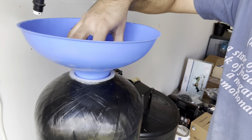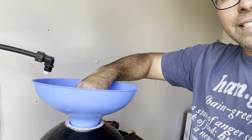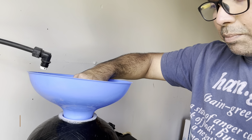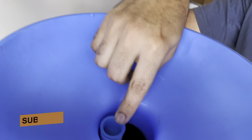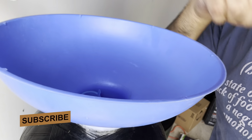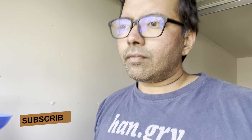The first thing I do is disconnect the pipe, put it in, and place it all the way down — you'll feel it sitting on something or touching the base. Just let it stand in the center. Because I have the safety cap, none of the gravel goes into the pipe. The layered approach is: at the bottom you'll have gravel — just like little rocks — and on top of that you'll have the resin. After that I just need to hook everything back together and we're good to go.